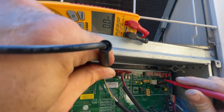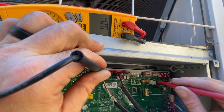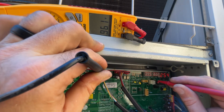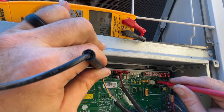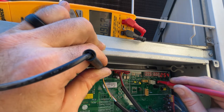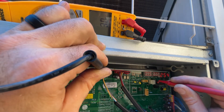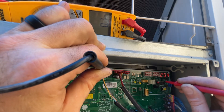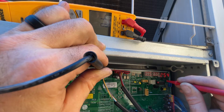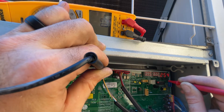I'm going to ground on this unpopulated capacitor space right here on the board and show you what normal looks like. Sorry, this is very hard to film, but I've got five volts when the switch is off, and when the switch is on I've got zero volts. I got these switches on and they all came to zero fine. Then I go over to DIP switch number 11 — it's also pulling down that 5-volt reference correctly.